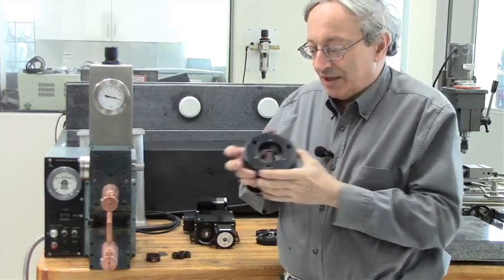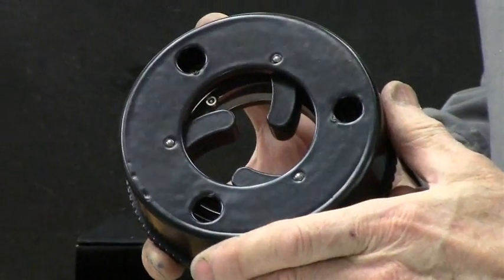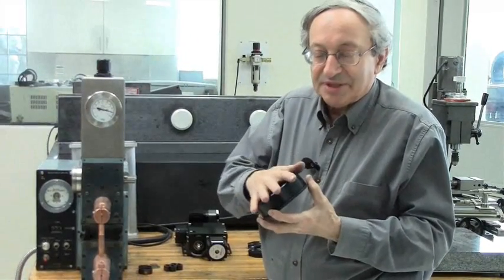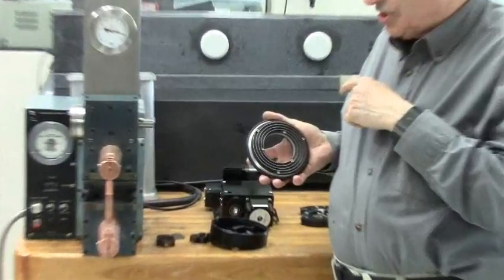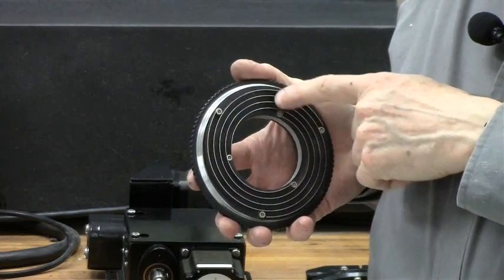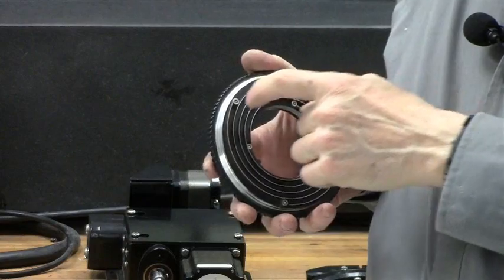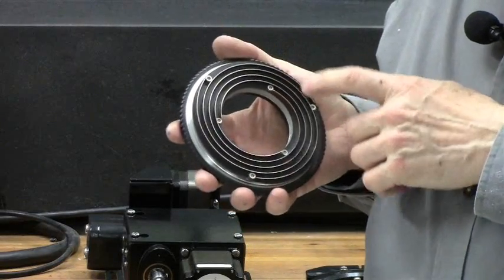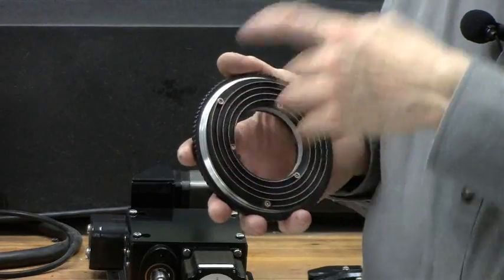Here is another example: a chuck that grips at different diameters when you turn it. This looks like a completely machined item, but surprisingly nothing in this whole thing is machined — everything is made from water jet parts. It's a pipe and a ring pressed together, and even the scroll inside that activates the arms is a water jet cut helix into which a flexible steel strip is inserted. The advantage is that the spring strip is already hard and smooth. If you had to do it from one piece, you would have to use steel, harden it, and grind it on a CNC grinder for good accuracy and wear resistance — quite a lot of work, compared to just inserting a steel ribbon into a water jet cut helix.